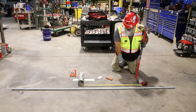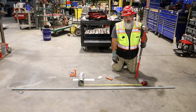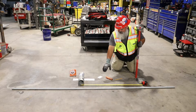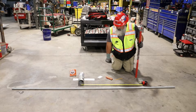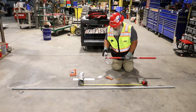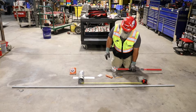I've put together a box here for our starting point and a round piece of pipe. We're going to be trying to stay on the same flat plane, then saddle over and get back to the flat plane, so we keep our strapping and run with the form of the building. In this example, we're going to have a bender. We're dealing with three-quarter inch EMT on this video.